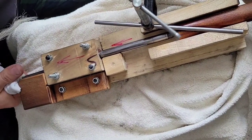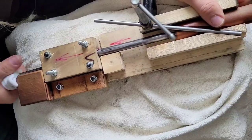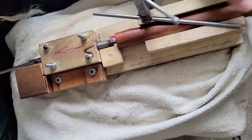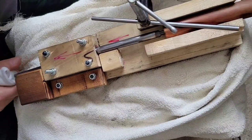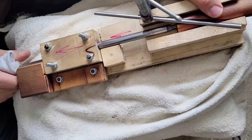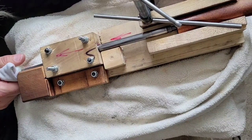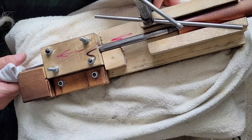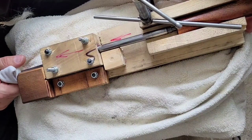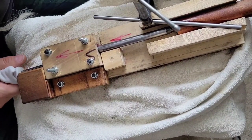A couple passes, and then index to the next flat. This would be the third one since I started this video. Make a few passes. It's a pretty good workout, and it's tedious, but if we try to make it cut too much at once, we'd get to the point where pushing this through by hand would be a real chore. There's a few cuts there. Withdraw, turn, next flat — so this is the fourth one.